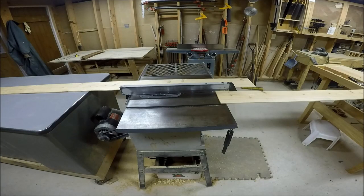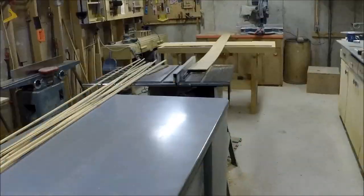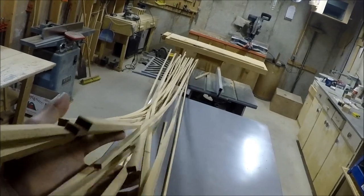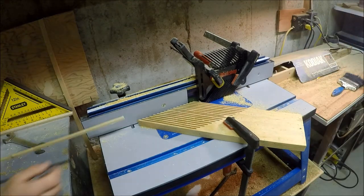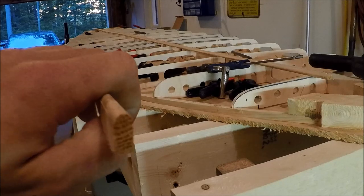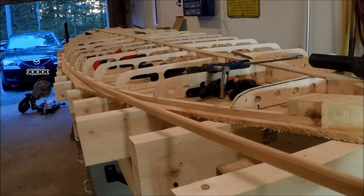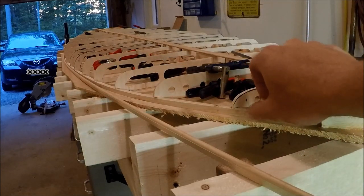So I'm going to rip some rails here. This board is a quarter inch thick. The first layer of rails is going to be half an inch wide, then we're going to switch that over to three-eighths just so I can do the radius. Just watch me put the tongue on these rails — you can see it pretty good there. Now this is the first rail that's going down, so I've left the bottom on a 90 because that's going to sit flat on the bottom of the hull and also up against this rail support right here.